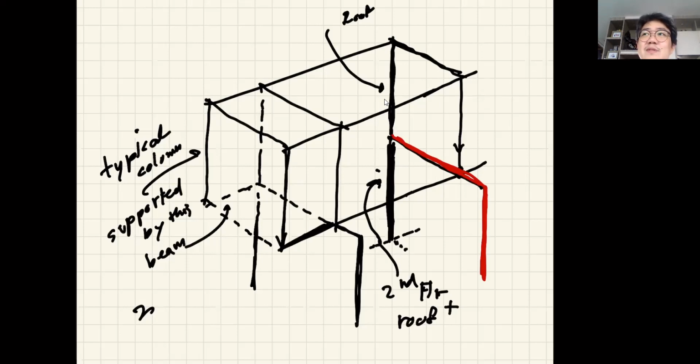And because you guys didn't go out with me in structural analysis number 1, I can tell you that if you walk around the Wissawa Watana building, you see cracks appearing along the stairs, right? The approaching stairs that you walk up to the building. That's because the ground around the building itself, the walkway, is not on the structure, so it sinks more rapidly. But the part of the stairs that are on the structure will not sink so rapidly.